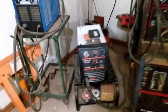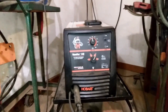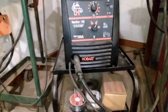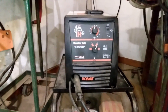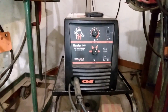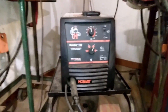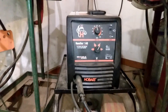As you see, I have a few. I'm going to build this particular backhoe with this Hobart Handler 140. It is a 120-volt machine, so it will actually plug into a wall outlet, and I'm going to use it in the wire feed mode using flux core wire — I believe it's a 0.030. I've done a lot of welding with it to get used to it before I start this project, and I got to say, this is a really slick little welder. It says right on here it goes a little over quarter inch, and I have pushed it — I have done three-eighths and it did, and it gave me a really nice weld.